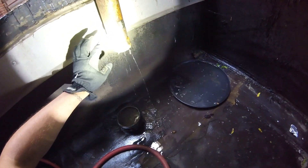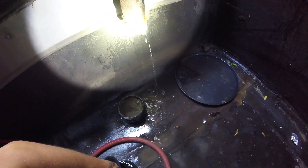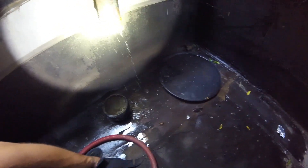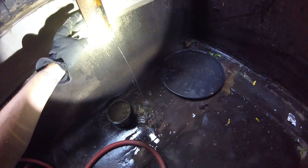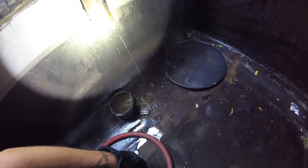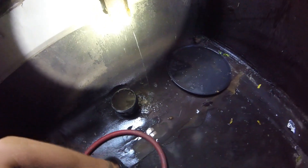I'm suspecting that the tower is not being filled up at the proper time because of the dirt on the sensor. Why is the tower not filling up? Well, maybe the float is acting up at times, or this solenoid is not actually fully opening the water. This is a little tricky one, but those probes are very dirty — I'm going to start by definitely cleaning that up.